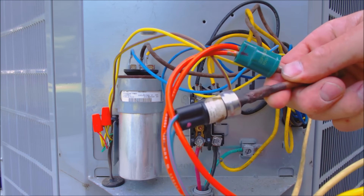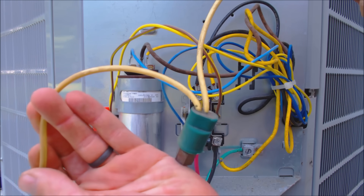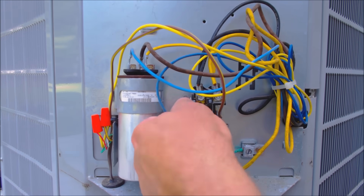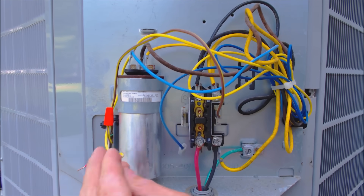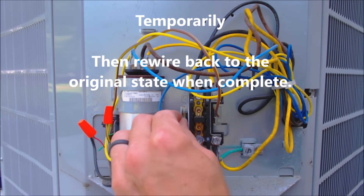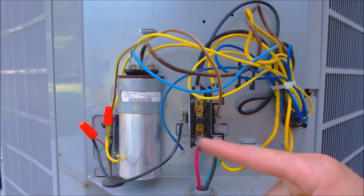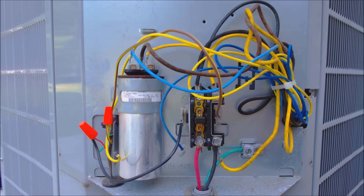The pressure switch may look like one of these — power comes in to one terminal, connects through to the other pressure switch, and then comes out to the contactor. It's very simple to take care of this. With the power off, pull the wire off and unwire-nut that wire. Then take a wire with a spade connector on the end and put it directly into the side of the contactor. Turn the thermostat on in air conditioning cooling mode, turn the temperature down real low, and you're ready to go. Stay away from this compartment while the system is running — there's a lot of amperage being drawn through there — and I'd rather technicians not press in on that contactor with a screwdriver the entire time, just for safety.